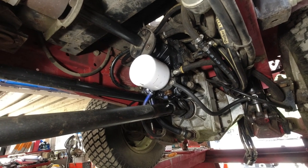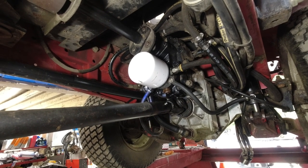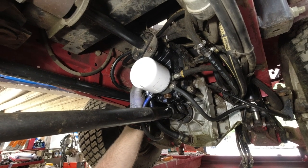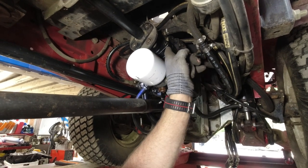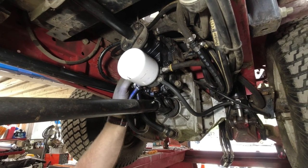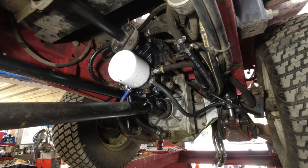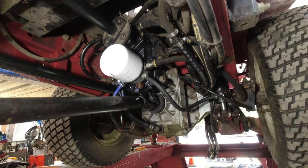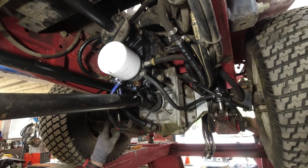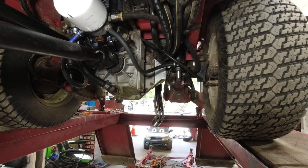Okay, we have done a lot of fault finding with my brother, and there is the auxiliary hydraulic pump, which is acting as a charge pump for the hydrostatic unit also. So it's first feeding the hydrostatic, and then the flow is used by the Orbitrol for steering and also for auxiliary hydraulics lifting cylinders. But you can see over here below here.